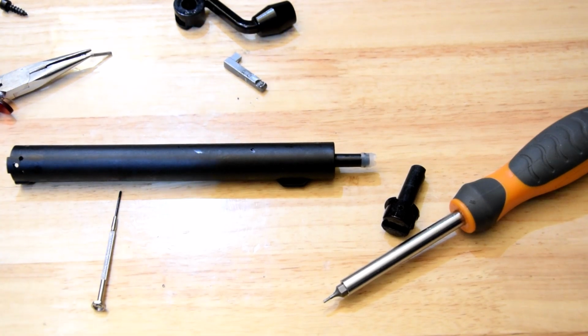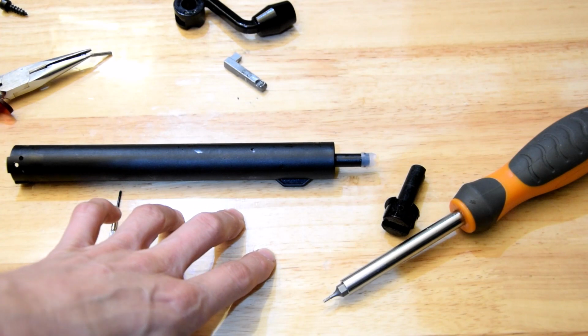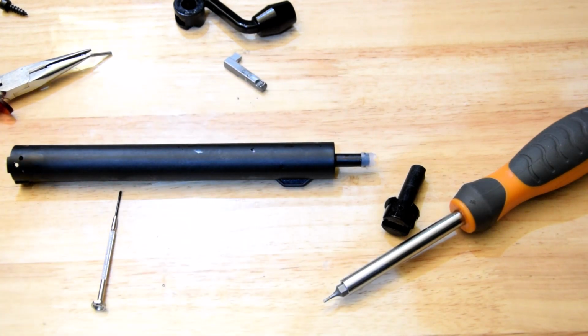Let's do some quick maths. A little bit of mathematics tells me that the cylinder volume here is approximately 21 cc's, and the short barrel with an internal diameter of 7.3 mils and 48.5 centimeters length gives me roughly 20 cc's, like 20.2 or something like that. So very, very similar volume in the cylinder to the barrel. Almost 1 to 1. In fact, 1.06 to 1 or something ratio, which is very close.